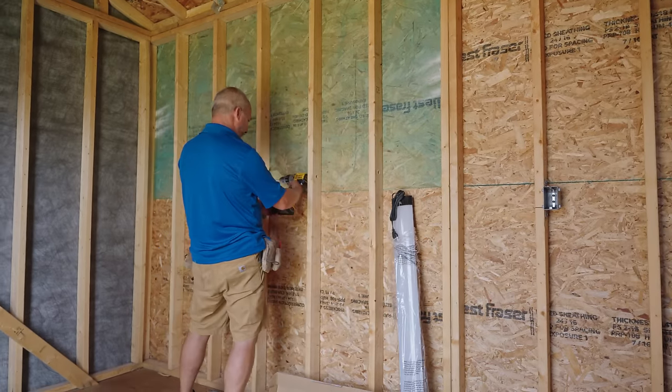Okay, the way we're going to do that. This is proper technique. Cross the wires. Use your square-nose pliers. Give it at least three twists. Okay, you want that knotted up nice and tight so it's never going to come undone. Square end, cut on an angle to the bottom. All right. Now we're going to twist this till the wires themselves are twisted as well.